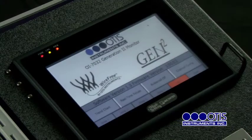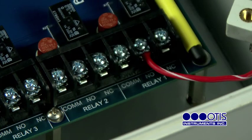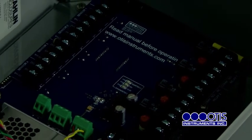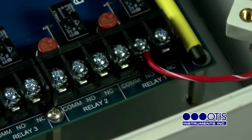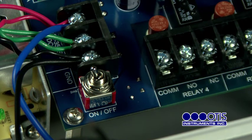Connecting Relays. The OI-7032 offers four relays to be set up. Each of the four relays may be set up as normally open (NO) or normally closed (NC). To begin, locate the bank of relay terminal blocks on the terminal board. Connect the live wire from the relay alarm to the terminal labeled NO or NC on the relay terminal block. Connect the neutral wire from the relay alarm to the terminal labeled GND on the DC power supply terminal block. Then connect the jumper wire from the terminal labeled plus 12 to 35VDC on the DC power supply terminal block to the terminal labeled COM on the relay terminal block.